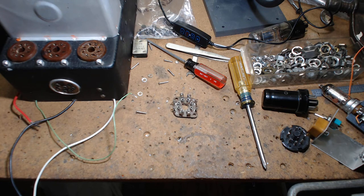You can operate this thing if you've got the right license. You can use the VFO built into it, but if you don't, you have to make it crystal controlled. Now, if you make it crystal controlled, you have 2 options. You can go in on the VFO and cut wires and add in a crystal socket and make that your oscillator. Then it's legal for a novice or a technician, the bottom end of ham. So anyway, I didn't want that option. I want to leave this original.